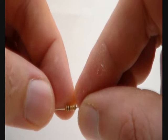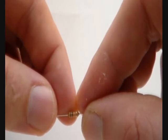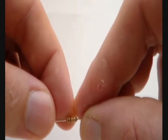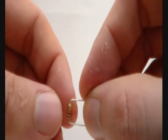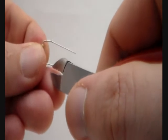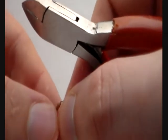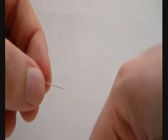Now I want to show you how to prepare the parts for this amplifier. First we start with the 10K resistor. We are going to bend the wires and then cut them so they are around 5 mm on each side. We keep the cut wires. Now we take the side cutting pliers and cut the wires to around 5 mm left on each side. So now we have two parts: the resistor with the cut wires and the leftover wire pieces — two of them.